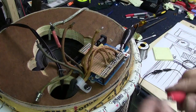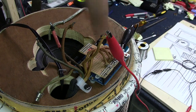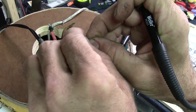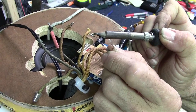The Arduino Leonardo is mounted up and ready to be wired up to the old-school cloth-braided wires. Wiring up the motors to the Arduino — to the H-bridge, actually, on the RUMBA mainboard down below. Turn on the switch now. Okay, that's the right motor reverse, and that goes on pin number five. So I can take that and solder it onto pin number five after I put a little fresh solder on here — this stuff is a little old.